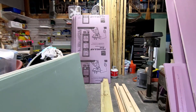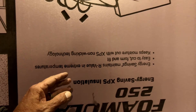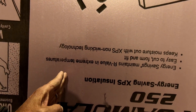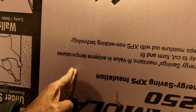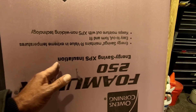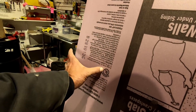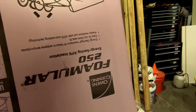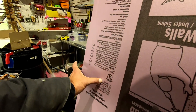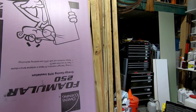So now what I need to do is cut these. First I'm going to split them — not in half, but I need 14-inch wide slices. I'm going to cut at about 28 and a quarter, split it that way to get them to a more manageable size, roughly in half. I'll get two out of that one piece, and I'll leave the remainder as a wide piece. If I just cut it in half, I'll have two skinny remainders and they'll be useless. The wider piece will be maybe five inches wide. So that's the plan.